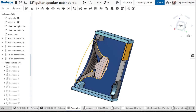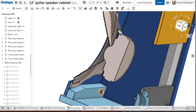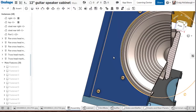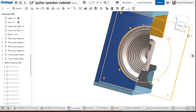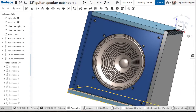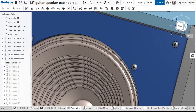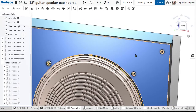But there's plenty of space in here, and it's all held together with all these cleats that are glued in, but the speaker baffle is using number 10 T-nuts. And so it's real easy to remove the speaker and replace it, if you want to test out different speakers in the cabinet, without having to tear it apart. And this is a 4 connection point design, where the baffle is only held on with these 4 screws, and there is also a provision for spacing between the baffle and the actual rear of the enclosure, if you want to put Tolex on here, as well as a speaker cloth.